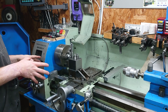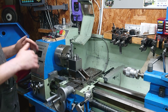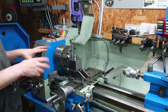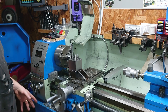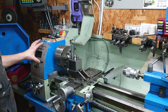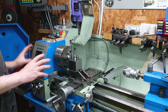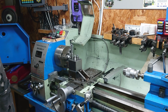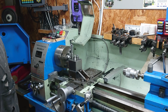So my question is, where do I go from here? Obviously I want to damp that noise down. Taking a step back, it's not an issue in aluminium or free-cutting steel — it's the harder materials, stainless and hard tool steels, that seem to be a problem. There is a cavity behind the spindle plate which I could fill with epoxy granite. The stand is obviously just sheet metal, and I have been planning for a long time to make a welded steel frame out of box section. Would that extra mass help damp out that vibration? Or is it just a fundamental limitation of the size of the lathe? I'd be interested to know what you think.